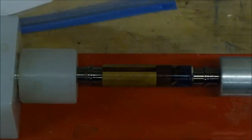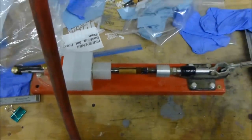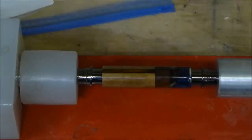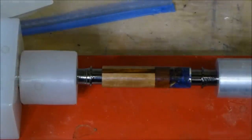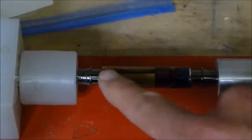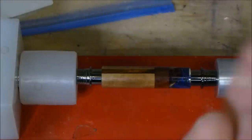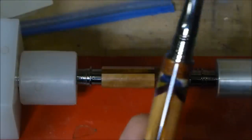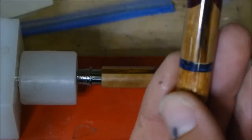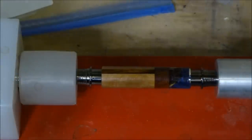Here's the pen press — cheap but works very well. That's the lower barrel. If you build something ornate with a center stripe, you want the cap to line up with the center stripe when screwed on. I've attempted to line up two center stripes so when you screw it on the stripes align. To do that you have to work with these threaded pieces and account for the thread alignment.